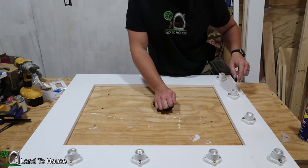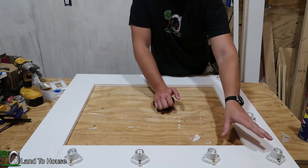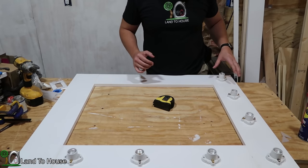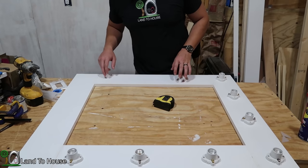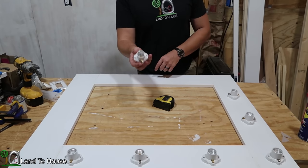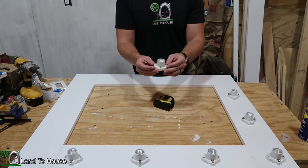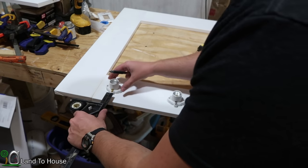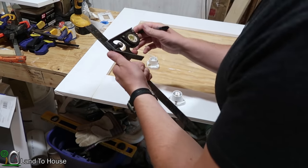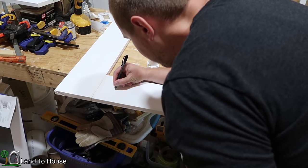I've set out the light sockets and done some measuring. I found that I like two and a half inch by two and a half inch on the corners. The separation between the next set is going to be eight and three quarters, and it is two and a half from the edge — same way with the top. There are going to be ten total sockets. What I'd like to do now is measure these out and start using my hole saw to make a hole big enough for the socket piece to fit through. It's going to be mounted from the back side, and all that will be seen from the front is just this white circle, so it should look fairly nice once installed.